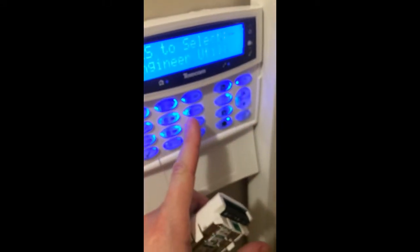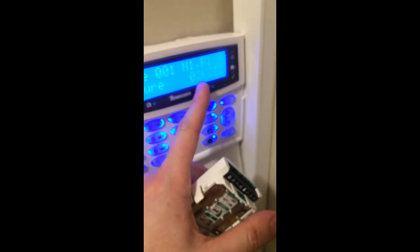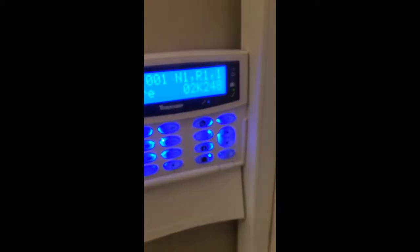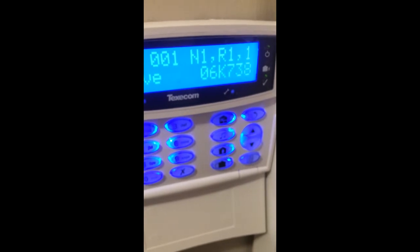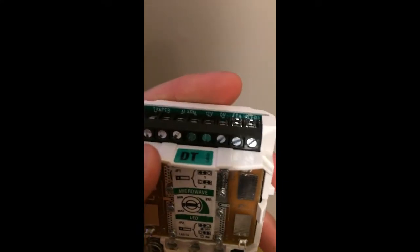And then this will do the magic and sort it out. If I go into my keypad and press number nine, press yes, press number three, press yes — I can then see that it's secure at 2K2. And if it was to go activated, it will then change to 6K9, which will be the resistance needed to activate the alarm. We went through changing that in the previous video, but I recommend using that setup.